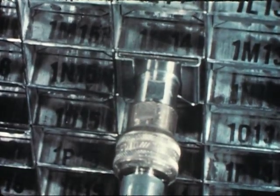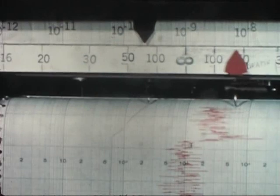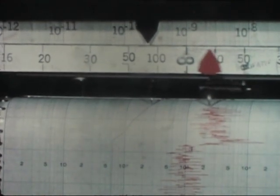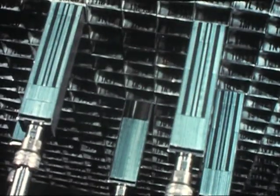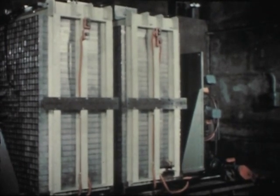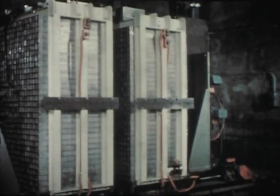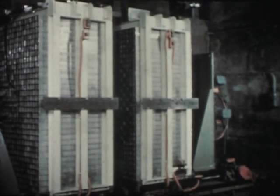Confirming information is determined by moving the remaining portion of the rod into the reactor. The reactor is now supercritical and will increase in power exponentially. Rate of rise in power thus recorded is a measure of the excess reactivity of the assembly. After obtaining sufficient information, a scheduled manual scram is initiated by the operator. The control rods are ejected from the assembly under air pressure, and the halves are automatically driven apart. These occasional scrams are intended to check the performance of the safety devices. Normal shutdown is accomplished by withdrawing the rods at slow speed. The critical mass of this mock-up was 161 kilograms of uranium-235.